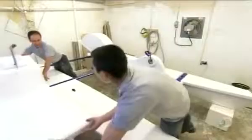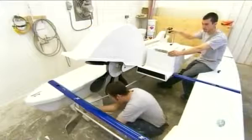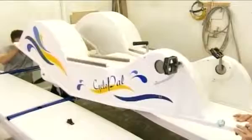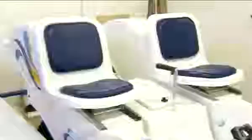After mounting the first bicycle, workers install a console in the center of the boat. It contains a waterproof storage compartment and the handle which directs the rudders. It connects to the rudders with a long bar called a tiller. Next, they mount the second bike, which is designed to snap securely onto the crossbars. The adjustable fiberglass seats slide onto aluminum rails and have fixed cushions in rugged, waterproof fabric. The boat's retractable canopy is made of the same fabric on an aluminum structure.